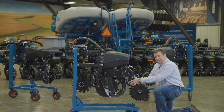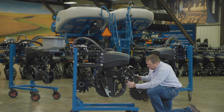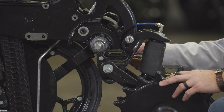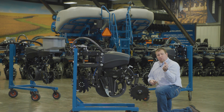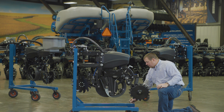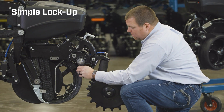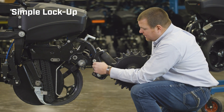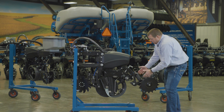We've done that by providing a quick lock-up closing wheel tail as a whole. Up front is a retainer pin, and similar to the gauge wheel arm, you use a small needle-nose pliers to simply pull the retaining clip. It's a double-wound style retaining pin so it stays in place even in no-till and high-residue situations. You push out that pin and rotate the entire assembly up and lock it out of the way so you can clearly see the seed trench.